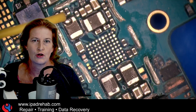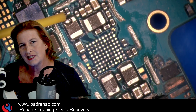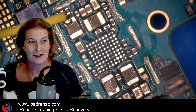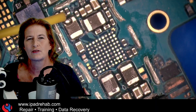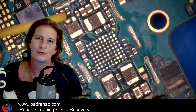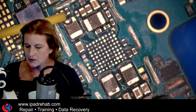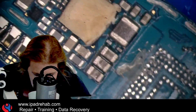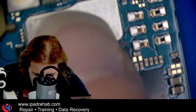Now we need to get another one of these chips. Normally I would draw the line here for a Samsung because there's not a ton of information known, and it's a lot more difficult to figure out what chips do. However, the S10E, like the S10, has a fairly significant number that have a signature trace crack in the board or some sort of a CPU disconnect. So we have a lot of donor boards — ones where we take the CPU off and are left with receiver boards. So it'll be easy to get a copy of this chip from a board that didn't have any water damage. Here's one where we did take off the CPU, but there's nothing else wrong — it's just one that had the trace crack inside the board, so it's a perfect one to harvest any of these other chips.